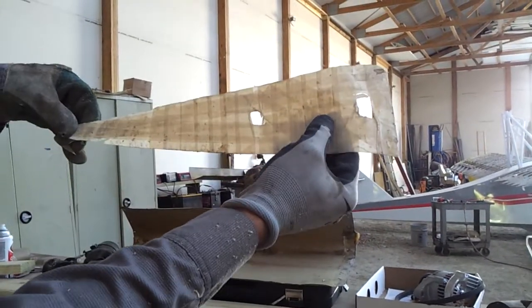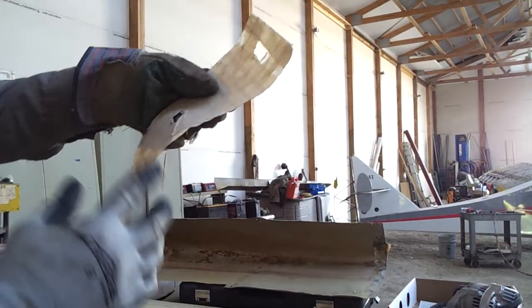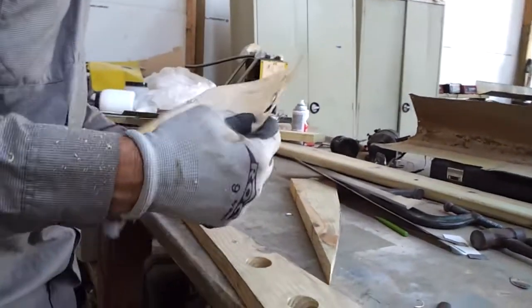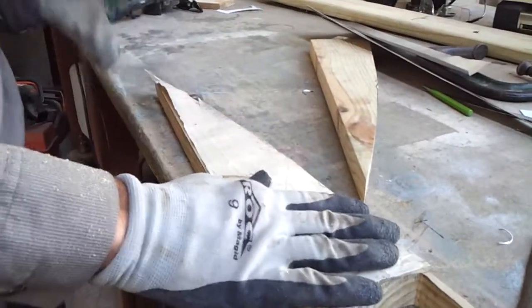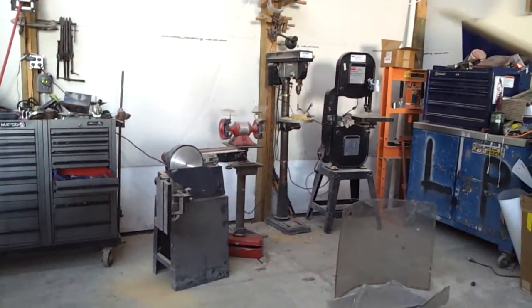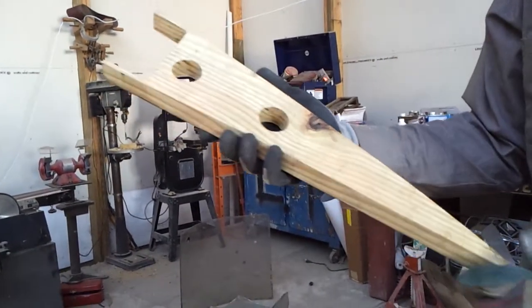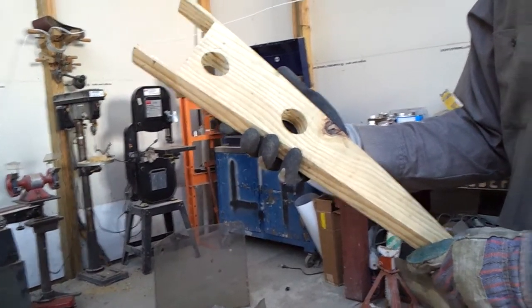What we did is we took tape and taped onto one of the good ribs. Took a pencil, once the tape was on there, rubbed along it so that we got the proper contour. Pulled this off, took a pair of scissors and cut this. Then we took that tape, put it on a nice board, cut the board to the contour. Took a belt sander and sanded it real pretty, nice and square, to the exact contour of the rib. And of course, we drilled a couple of holes in there for the aileron cables to pass through.